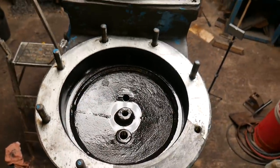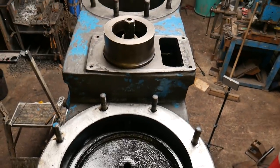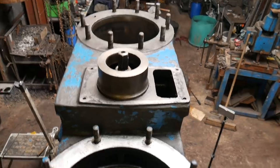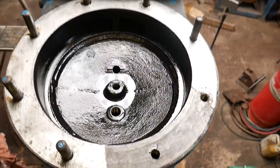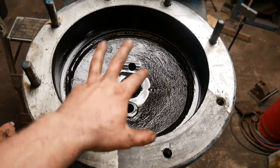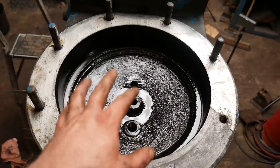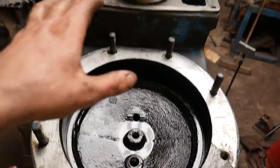Okie dokie, so it's the next day, I'm standing on the flywheel, this is the compressor end, and there's the valve, and that's the working ram, and I'll just go over some of the things that we've been doing. So I'm taking the top off here, I just wanted to check to see if the cylinder had any scratches or scores or anything on it like that. It's looking pretty good, and there's oil and everything in there, so I'm quite happy with that end.